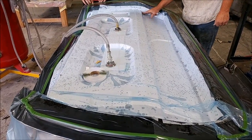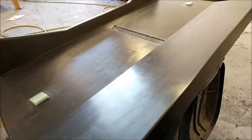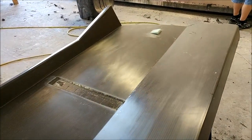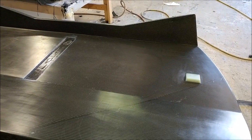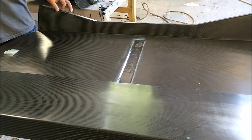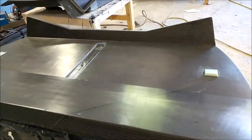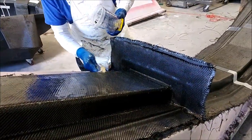There it is actually released from the mold. You can see those little FR4 inserts sticking out with a little bit of cabosil resin — those are where the top part of the landing gear scissor mechanism bolts into place. They're hard points put there, and that insert in the middle meets up with a brace that matches up to the aft bulkhead.